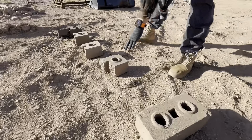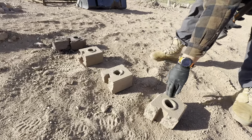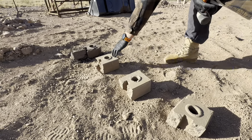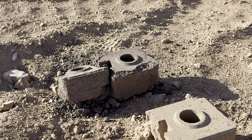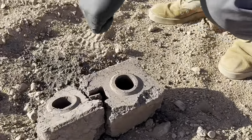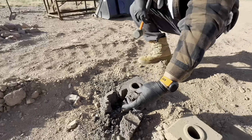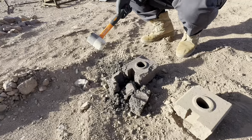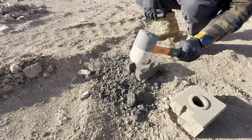Going in this direction, they're fairly dry but mixed with higher contents of clay. So this has a little bit more clay, this has a little bit more than that one, and that one is actually from a buddy's property that is very high in clay content. Let's start with that one because we can see it's already crumbling pretty bad just from picking it up — clay shrinks and expands when wet, so that high of content makes it really prone to cracking. And that took zero effort whatsoever — it just disintegrates into nothing.